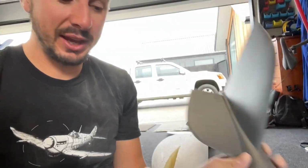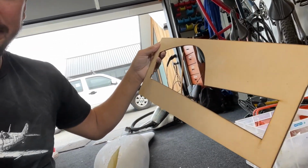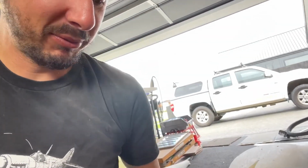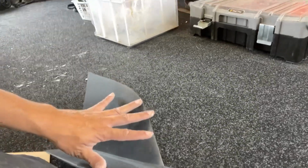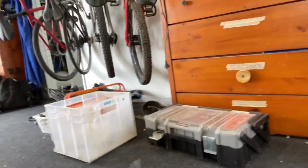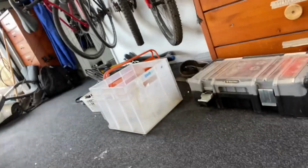They need a sand, but they also need parting boards. So I've been making some sample parting boards out of MDF, trying to work out exactly what shape it needs to be, so I can set this mold in probably 3 pieces. So it'll be one off the top here, one off the side this way, and then one off the side that way. That'll make the 3-piece mold, allow good draft angles to get the part out. But yeah, finding the right shapes is proving a bit tricky, so I'm not quite there on that one. Almost, but I just need to bring that curve down a fraction.